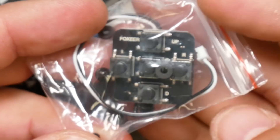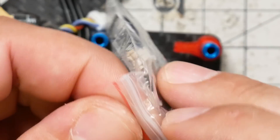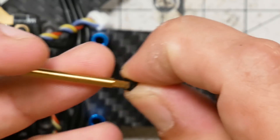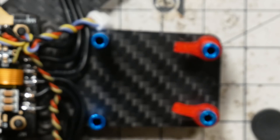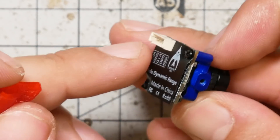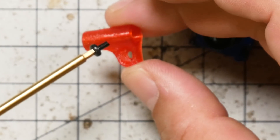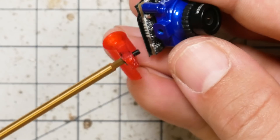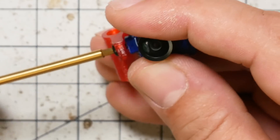Having installed the 3D-printed brackets, we're going to open up our accessory bag and get the screws out. The screws we're going to use are M2 — 2mm head screws. We're going to use a 2mm driver and just install them. It may actually be a little easier to install these brackets on the camera rather than on the frame. Here's the camera — make sure you have the top up. What I think is easiest is to take the bracket, sleeve side out, insert the screw, and then just screw that into the camera.